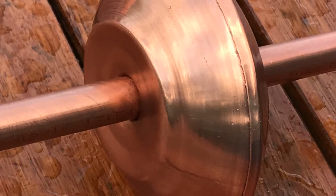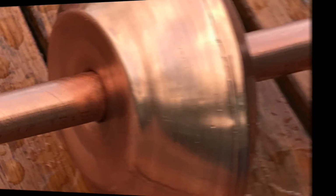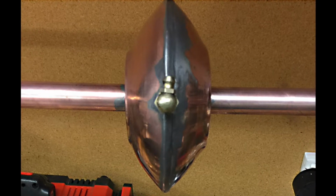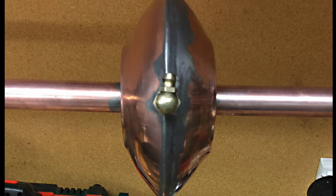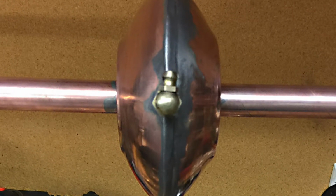And that was actually done in the lathe as well to make sure that the holes are kept straight. Then I ran solder into the rolled over edge to seal it properly, and in this photo you can see a grease nipple I've placed here. I've taken the little ball and spring out of it, so now it acts like a jet.